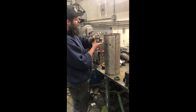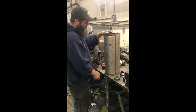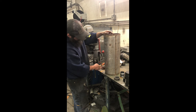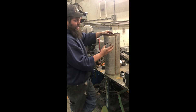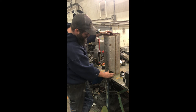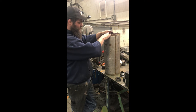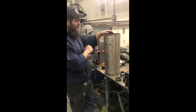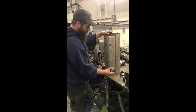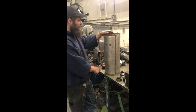Take this nipple, cut it in half, set that guy on there, weld it down and water test it. Then we can fit it into the drop box housing. But before I finish putting the fins up here, I can see my last row is about right there right now. Here I've got half of a pipe coupler — the other half from what we welded onto the fire tube. We know this is going to be located somewhere in here, but we won't know exactly where until we put the floor on here and put that pipe nipple on and thread it down. Then we'll know where we want it to come out of the heat exchanger body and get it welded on.